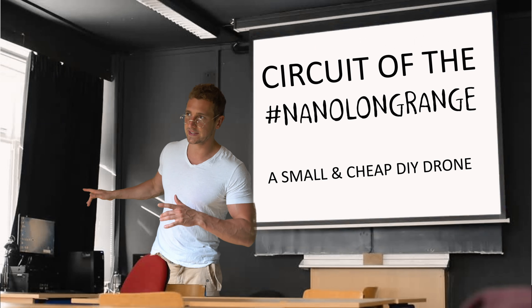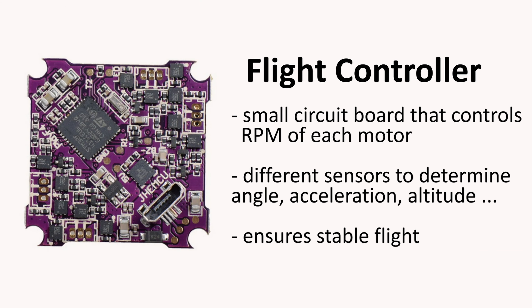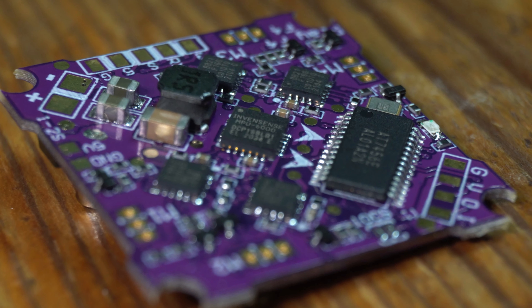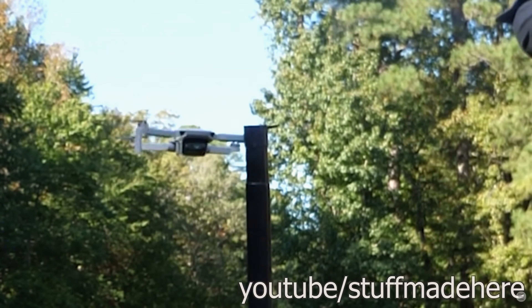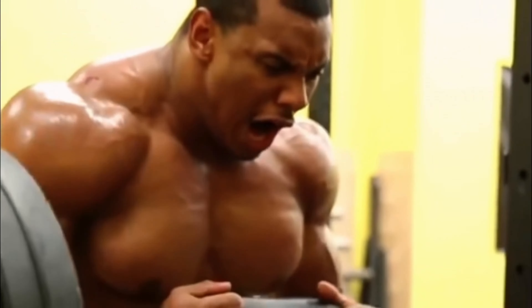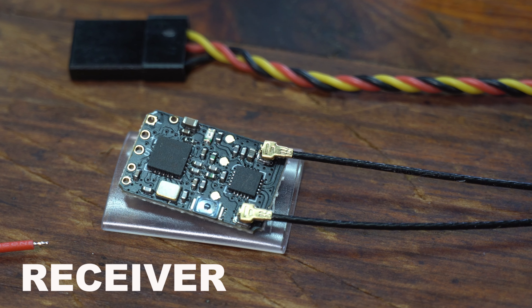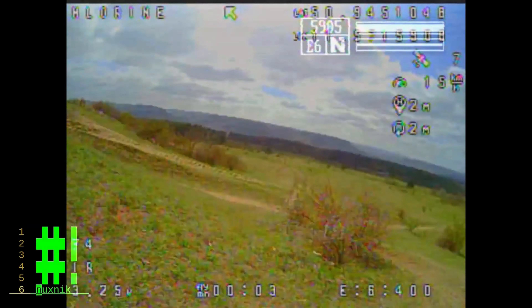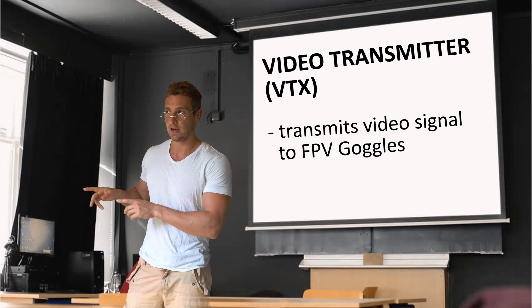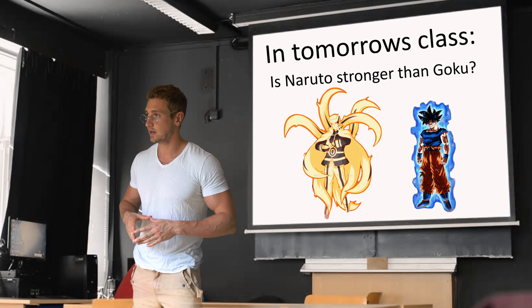Now let's take a look at the circuit. It seems a little confusing at first glance, but it really isn't that complicated. The heart of everything is the flight controller — basically the brain of the drone. It has several sensors attached to it which can measure angle and acceleration with which the drone is moving, then calculates the speeds at which each motor has to turn for stable flight. The entire drone needs enormous amounts of power, supplied by a lithium-ion battery. The receiver receives the radio waves coming from the pilot's controller. There's a tiny camera in the front of the frame which creates the first person view, transmitted to the pilot's goggles by the VTX — the video transmitter. And boom, the drone can take off and save the gym bros.